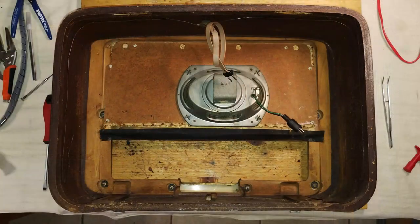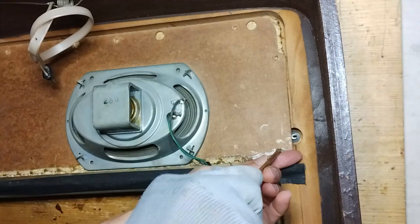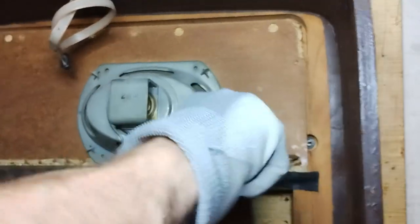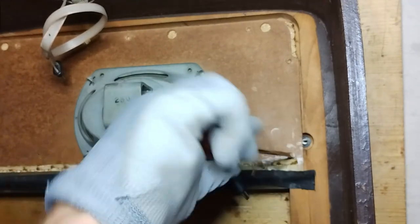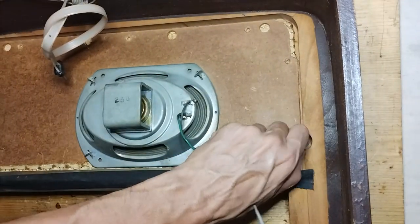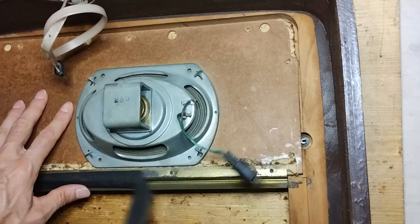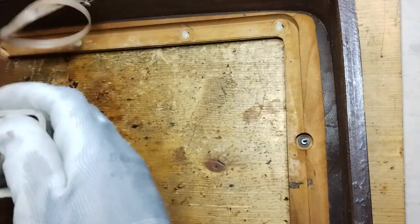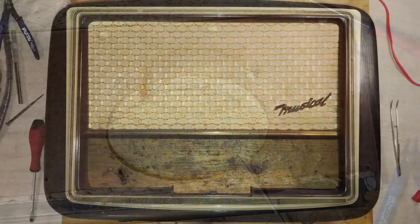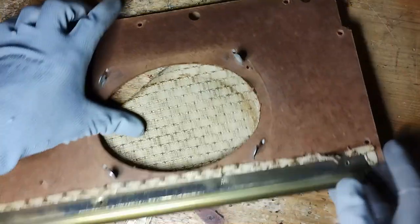The thickness is about 5 millimeters, and everything else that appears thicker is just a frame that keeps the cabinet together. There are no specific pictures about what has been done to the cabinet. Some lacquer thinner has been used to smoothen the original lacquer without stripping it. Then red oil first and dark brown wax last have been used to polish the surface. While using the lacquer thinner, also the white plastic frame on the front has been cleaned.